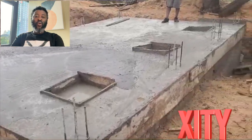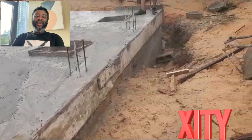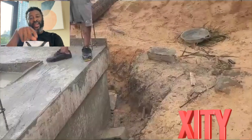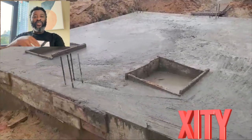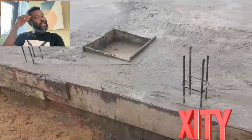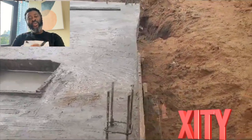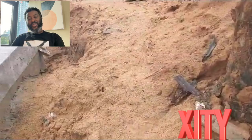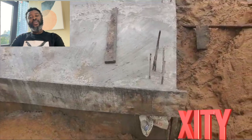In this portion of the video, the walls have already been erected and the concrete is dry, in the process of drying. They started backfilling with sand around it. Those three openings at the top are currently covered with wood that forms the frame to the opening. We'll remove those planks and wood so you can get into there, and then we'll drill the holes through the partitioning walls. Each of those three square-shaped grooves you see on top of the septic tank will be an access point into each of the three vaults. We'll put a ladder in there and drill the holes between the partitioning walls, just like we did last time.